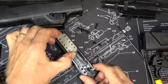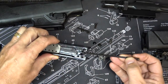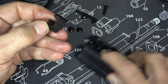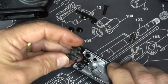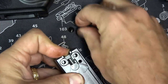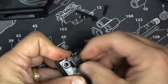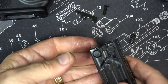Now let's reassemble in reverse order. Drop in the weight, then the firing pin spring. Now we're going to reinsert the bolt face — notice that this flat area corresponds with the flat area up here, and we have a little cup at the back. Get it set; there should be a little bit of spring tension, and that's going to allow us, with it pressed, to drop in these two pins. Once they're in, release the bolt — it's going to hold that into place.